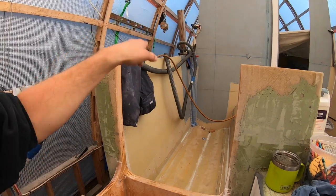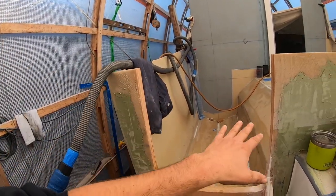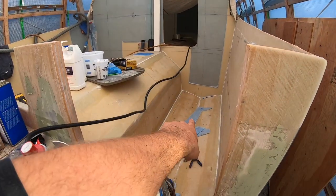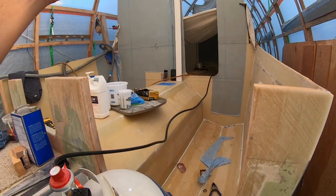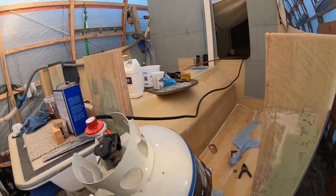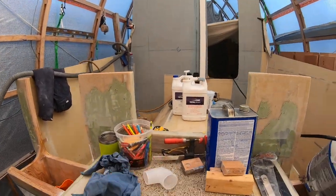Tomorrow we'll pull the peel ply off the sides and do the same thing — do the outside of this bulkhead, and then I still have to do the berth area and bulkhead one. In the next few days I want to start getting these intermediate bulkheads cut so we can get some floors down, because it really is a pain jumping around. That's got to be about a two-foot step up from the bottom of the hull to that door frame. I'll concentrate on one hull first, get all the intermediates cut, hopefully glued in place, and then just lay plywood on it so we can walk around comfortably. All right guys, thanks for watching — be sure to like, share, and subscribe. See you next week.